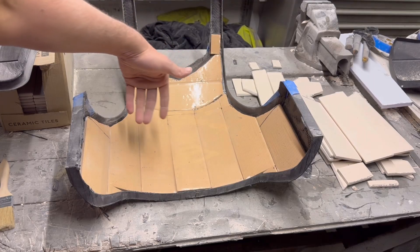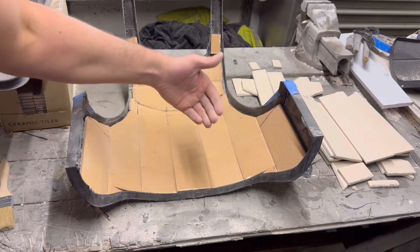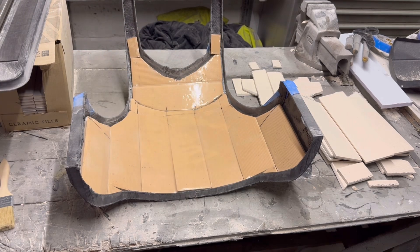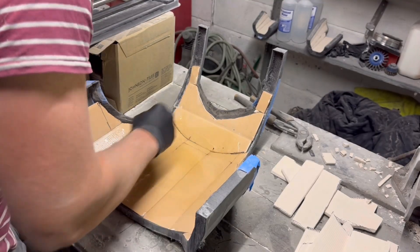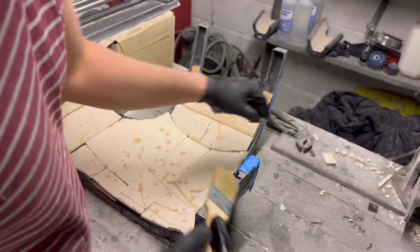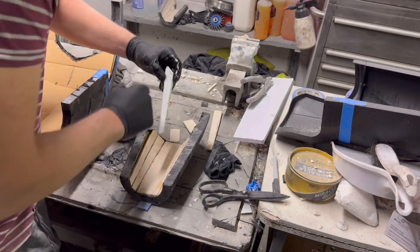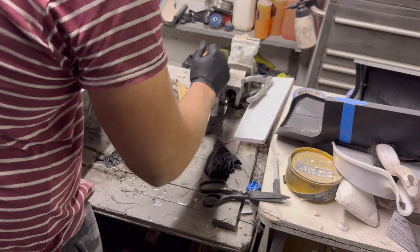I will be trying to overlap all of these tiles as much as possible. The only thing is, if I try to do a 50% overlap of each tile, what you end up with is a big void between the two tiles where they bridge over from each other. So I'll be packing them as tight as possible, but then allowing the curve of the armor to actually create the overlap for me - that way there won't be any unwanted voids. I will also be making sure all of these tiles are well glued together and the outline is well glued and packed out so there's no play. I'm also pretty much settled on having a 1mm steel backing plate bonded to the ceramic on the back, so once that is securely fastened, there'll be nowhere for any of these ceramic tiles to go - meaning there shouldn't be much of a weak spot for anything to come through.